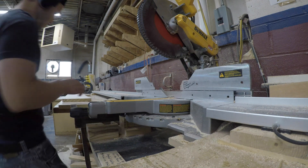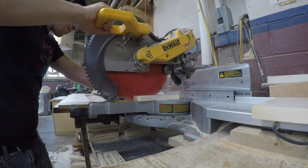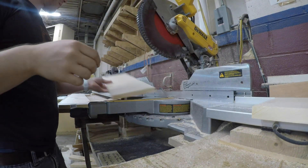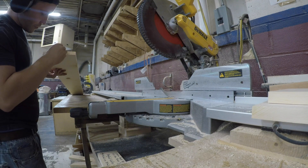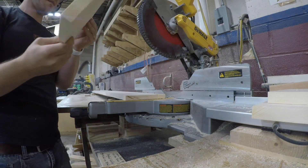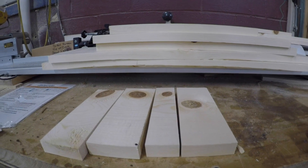So, with the design finalized, despite the grammar faux pas, I could get to prepping my materials. For the backing board, I decided to use three-quarter inch solid pine so that I could cut it on the laser cutter. Pine is fairly soft, so the laser can cut through it like butter even at that thickness. I'd have preferred to make it out of a nicer hardwood, but the laser has a hard time cutting through hardwoods without scorching when they're much thicker than a quarter inch. For thick hardwoods, a CNC would be a much better choice, so I'm eager to get my hands on one of those someday. Despite its great cutting abilities on the laser, pine is notorious for having knots sprinkled throughout the boards, so I carefully cut around all the knots present in my 8-foot board so that the scrap pieces could be used for other projects.